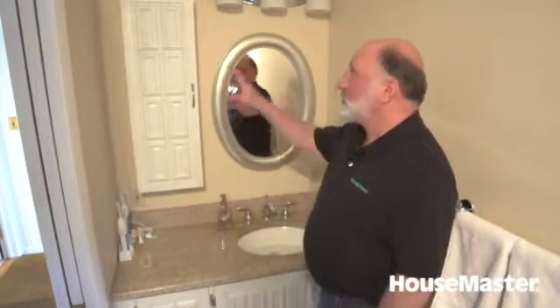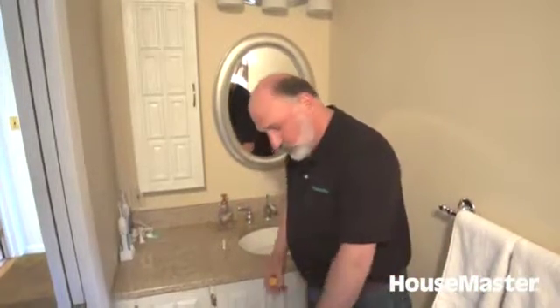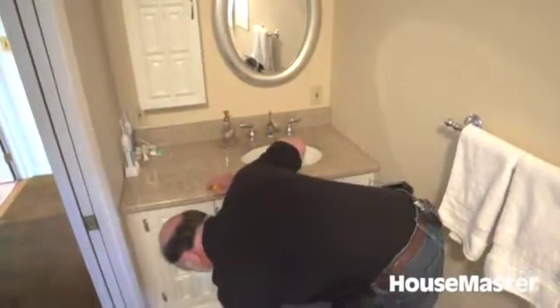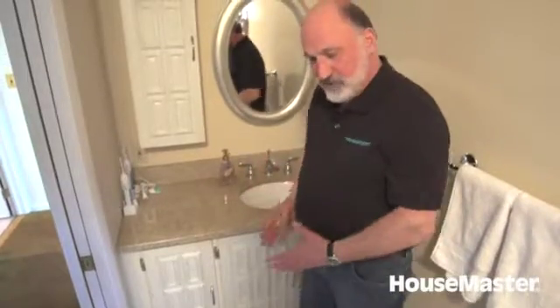At this point, we scope our eyes across the ceiling to make sure there are no stains or cracks, and note just about anything we see. We check the flooring — the flooring is tile here, and sometimes there are rugs. We'll move the rug aside and look underneath to make sure they're not hiding anything. A lot of times right in front of the sink or toilet, you'll have water damage that could be covered by carpet, so we want to peek under there and make sure everything looks good.